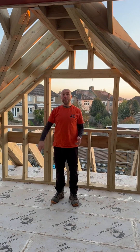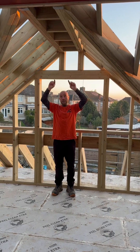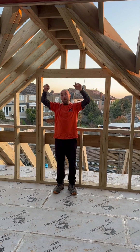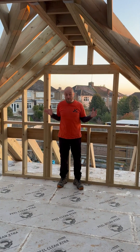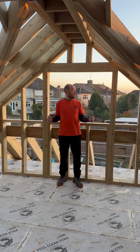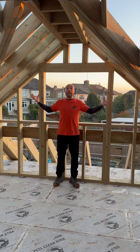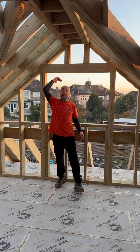Tabletop roof dormer. The pitch can't go any higher than the existing tabletop roof, so there are only two ways that can happen: we could either reduce the span to bring that pitch lower, or keep it as wide as we can so we can get the opening here — the main feature of the room — to let in as much light as possible, get as big a window as we can, and just have the tabletop at the top.